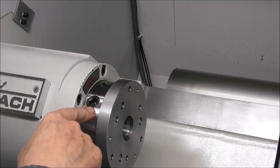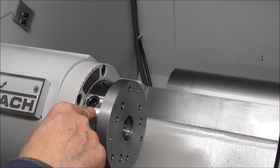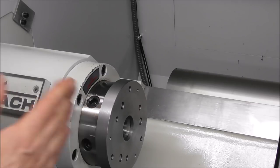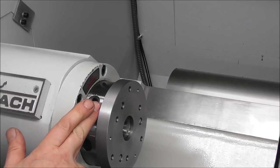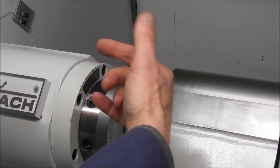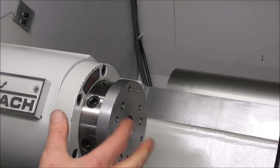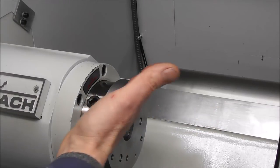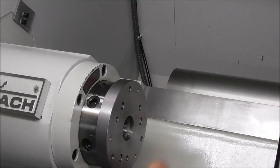Yep, that's good. So you machine it in a position that's convenient to hold and repeat accurately and quickly cut, but you're machining it 0.8 of a millimeter closer to that face of a 1 millimeter pitch thread, and then you're backing it out 0.8 of a turn to get it to the correct place. Not a whole turn, because I'm allowing for the 20 degree discrepancy in the camlock system that they use. It's on a 20 degree offset from a radial line.